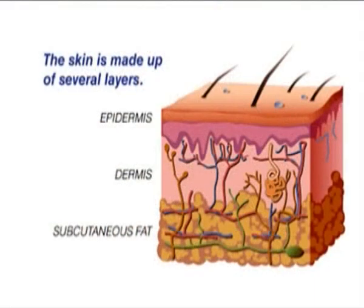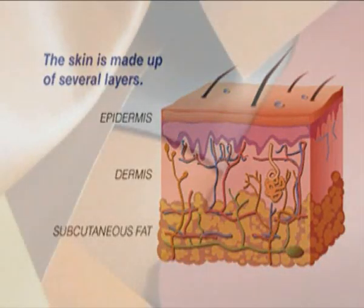chains. The skin is made up of 3 layers, being the epidermis, dermis, and subcutaneous layers. The dermis consists of 30 to 35% protein, which is mostly collagen, with the remainder being fat and water. It is the dermis that is used to make the leather after the other layers have been removed chemically or mechanically. The whole tanning process uses acids, alkalis, salts, enzymes, and tanning agents to dissolve the fats and non-fibrous proteins, as well as chemically bond the collagen fibers.